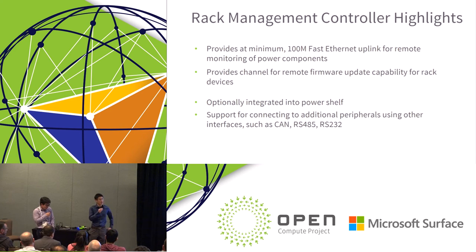And part of what also happens is, as you go to high power racks, you start running into issues with cooling, and it becomes harder and harder to cool. That's actually one of the driving factors of why we decided to introduce a shallower depth rack. Let's say you had some GPUs that were very high power. You would not put many sensitive items downstream, so that's wasted space that you would just use for extended bus bars. So as the racks get higher and higher power, some of them available today that we've seen on the floor can handle up to 36 kilowatts within these essentially 19-inch racks.